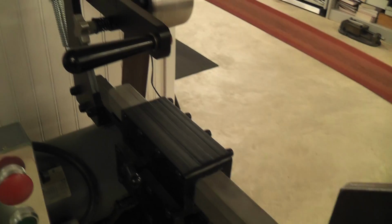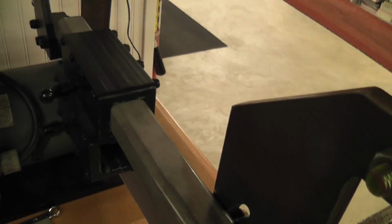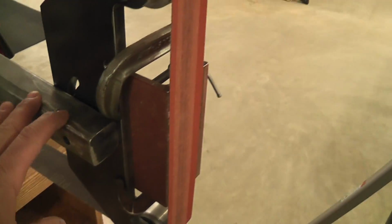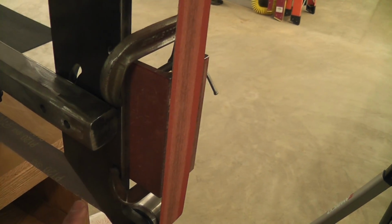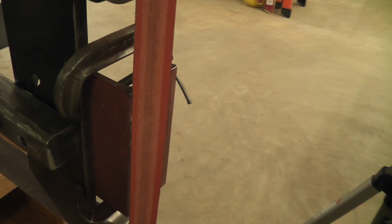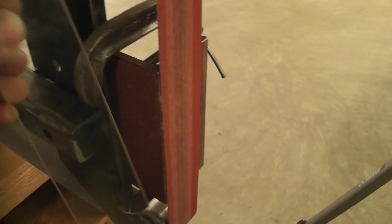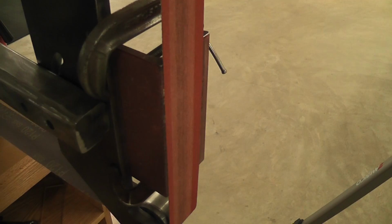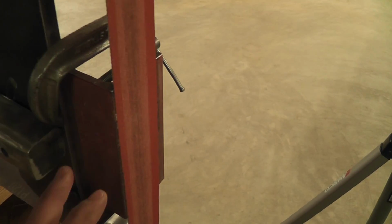The grinder in a box kit has a couple main components here. These are the 2 receivers. The top one is for the tool arm. This is the flat Platen tool arm that I have. I'm still working on the actual Platen itself that goes in here. I have a piece of tempered glass that the belt will ride on to make it nice and smooth and to reduce friction and heat. I still have to make all of that.